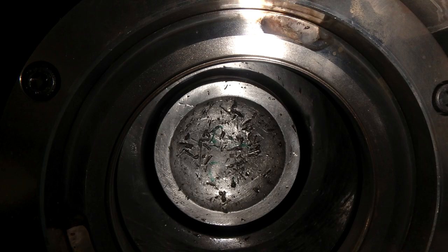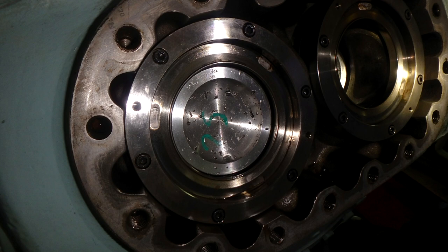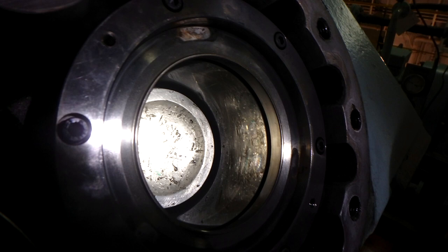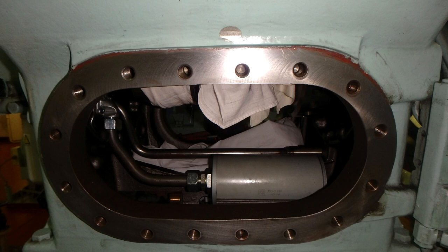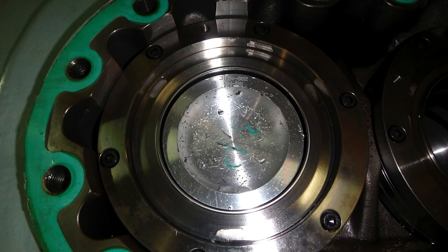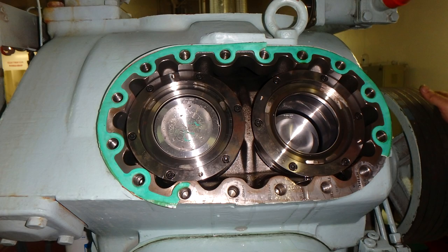One thing that is a little bit tricky here is to dismantle this unloading equipment from inside the air conditioning plant, because you will use an Allen key, and it's a little bit difficult for your arms to be placed there. There is a small space to do such a job, and there is a trick to turn this equipment so you can dismantle it. Also, you must be very careful when assembling that kind of unloading equipment, because if you don't put it in correctly, you will not match the other parts after you mount the springs. This is the most important. So be careful how you dismantle everything and how you mount it back, so it will be in the same position. Just keep this in mind.